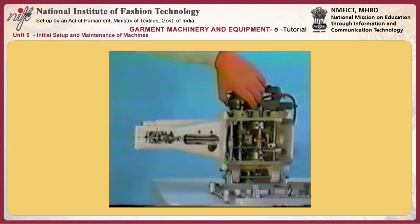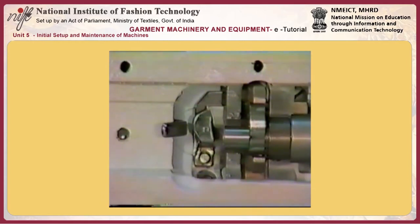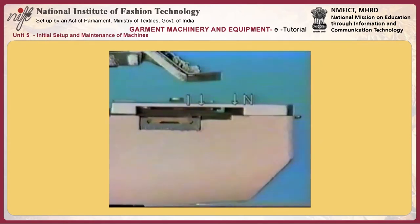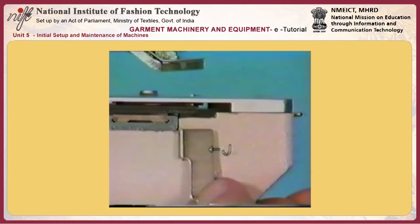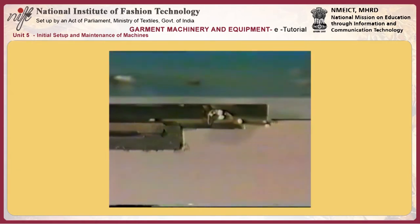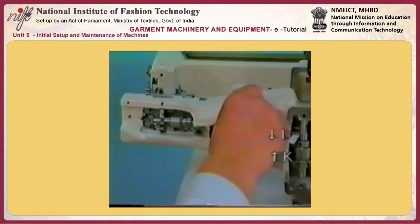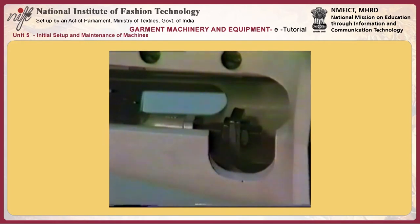Turn the pulley to make the sewing machine enter the stop motion state. When the machine enters the stop motion state and the button clamp is fully raised, a standard clearance of 13 millimeters should be obtained between front connecting plate I and end face N of the slit in the throat plate. To adjust the clearance to 13 millimeters, moving knife positioning gauge J is necessary. Loosen two nuts K of the screws in the thread trimmer connecting plate and adjust the clearance to 13 millimeters by moving thread trimmer connecting plate L back or forward.